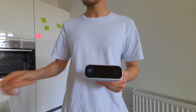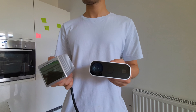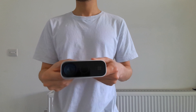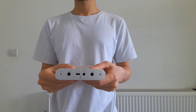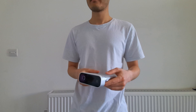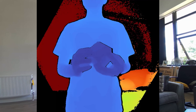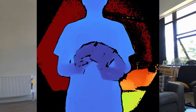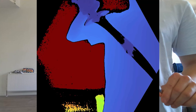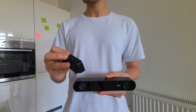All right, I know we spent a lot of time talking about the flaws of this sensor in this video, but that's really meant to show you the nuance when using it — not just to criticize it. It's still a very high quality sensor with very good depth maps. If you're primarily interested in indoor applications and you need very dense depth maps, this is probably the best option on the market right now. But if you are primarily looking to use this sensor outdoors, or if you want to use it for localization or other challenging illumination environments, it may be worth considering some of the other alternatives out there.